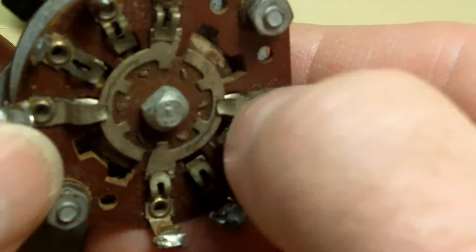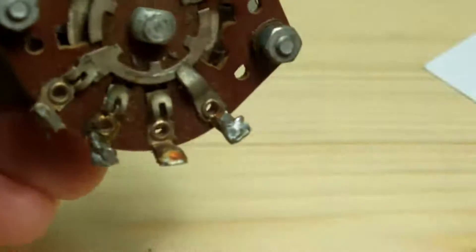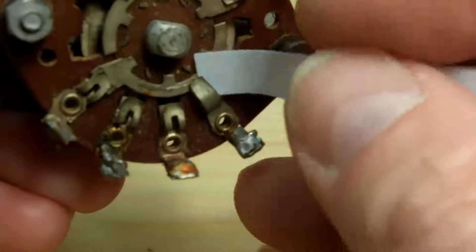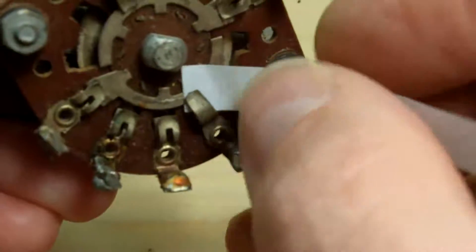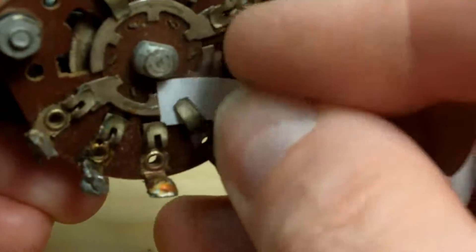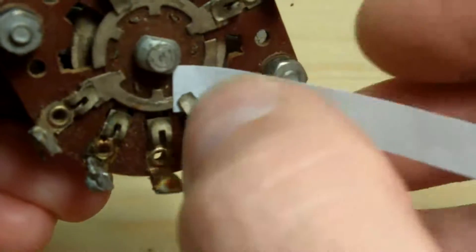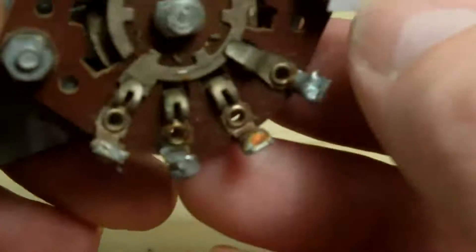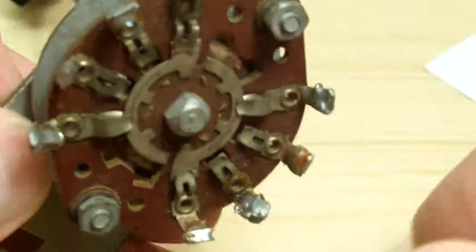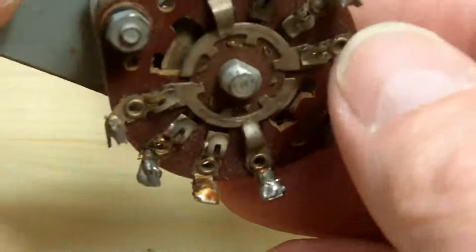Never use sandpaper or emery cloth to try and clean them. A little bit of switch cleaner and a little bit of paper can be used to get under there. It's very rare that you need anything other than switch cleaner — a little bit of paper and a little bit of WD-40 on it — just lubricate and clean the switch. I hope you found that interesting and helpful. Thanks for watching. Bye-bye.